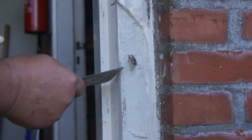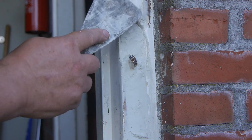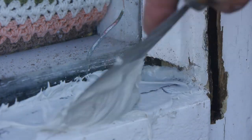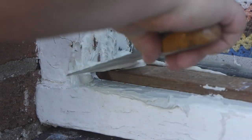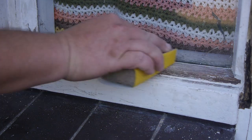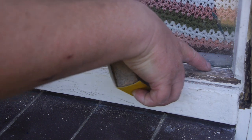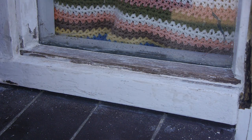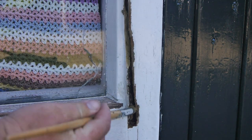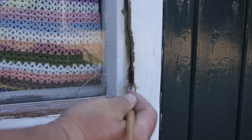I think that looks reasonably good. We'll see how it dries - and of course I couldn't find my small putty knife so I had to use my hands. Whatever gets the job done. No nails needed. I know it's a pretty amateurish repair, but once I put some window sealant around the edges I think it should survive one or two Dutch winters. Some wood rot primer for this big rot crevasse, and then it's time to take a break because it's going to be a hot day - more than 30 degrees and I don't like the heat.